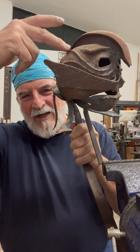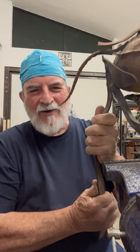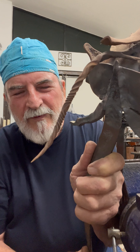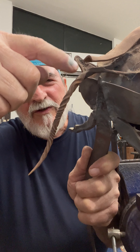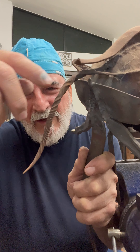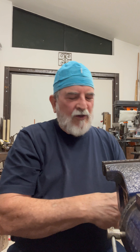A lot of detail and weird stuff can come out of your head. These ridges along the side are quarter-inch rod for a thicker, weirder look. There's also a little ponytail in the back — forged to a square and a point, then twisted. This is actually a reverse twist: you do a half twist, then move on, come back, and twist the opposite way. Fun stuff — I'll show you more about that kind of thing later on.